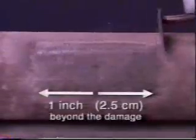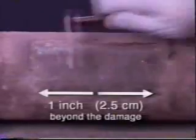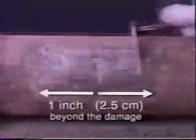After isolating the leak, clean and dry the area thoroughly with a rag. To prepare lead sheath for repair, scrub the surface with a carding brush until shiny, or use a shave hook to remove the dark oxide from the surface. It is important to completely remove all contaminants from the lead — clean at least one inch (two and a half centimeters) beyond the damage. If the leak is on a seam or joint, clean and repair beyond the leak along the length of the seam or joint; otherwise the leak may jump beyond the repair patch.